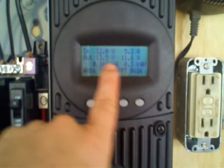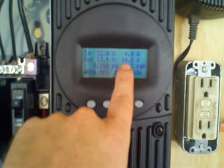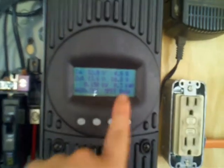The most we've ever pushed is 100, and I had it up to 250 a little bit ago. But I think because the batteries are charged, it's not taking a whole lot of kilowatts. We've got 32 volts in, 13 volts out, 11 amps — sweet, producing electricity. And in the past couple hours that I've been working on it, it looks like 0.3 kilowatts produced since I got it hooked up.